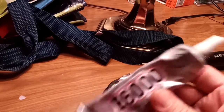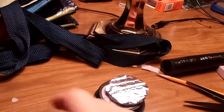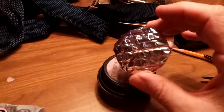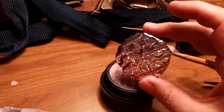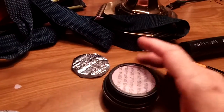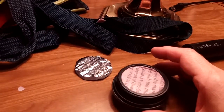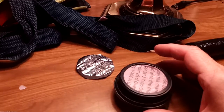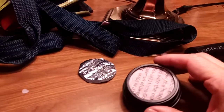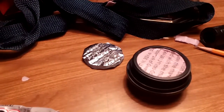I've already drilled the hole, put the plug in, and siliconed it. I'm also going to put the pipe in — you'll see the hole. I have a few pictures I'll post as well that will show the expanding foam. Basically you have the subfloor, and once the subfloor is drilled there's some loose insulation there, then a cloth wrap a couple inches down. A lot of that insulation comes loose, so the expanding foam will seal it up.